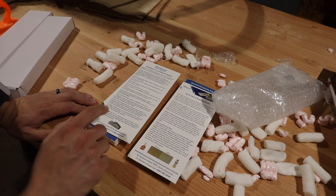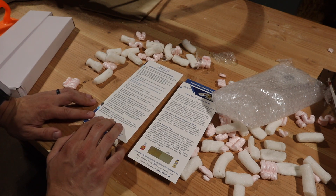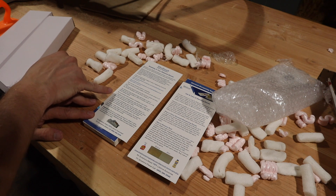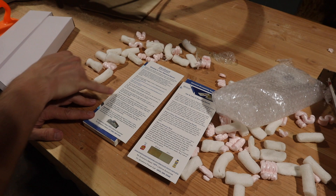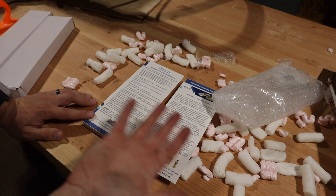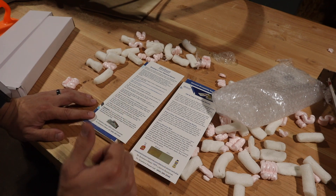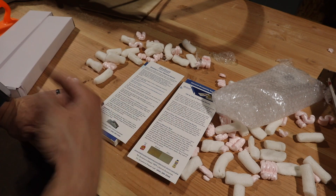The recommendation on here is: don't try to flatten the back of a chisel or a plane blade with a new diamond stone because you still need to break it in first to get that really flat, smooth surface. There are three primary ways to do it: one is to sharpen as you normally would with a large dull knife — that's the method I used the first time. Another is to run a piece of hardened steel over the surface. The third is to flatten a water stone, since the diamond stone is harder than the water stone and will break the surface free. Essentially, you're breaking free excess diamonds, which is a normal part of the process.